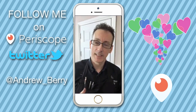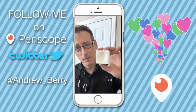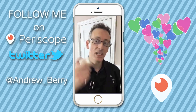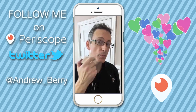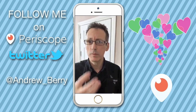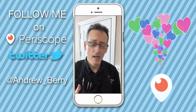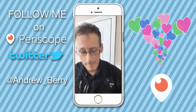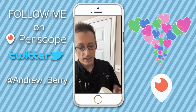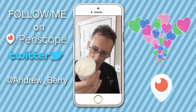When you start to melt down, you just simply can't rock up with your crucible and start melting silver or gold into it because it just doesn't work. You've got to prepare the crucibles. They're quite rough and can be quite porous, so we need to prepare them with something like borax powder — this is a flux. You can buy it powdered.